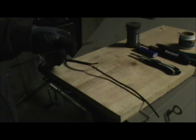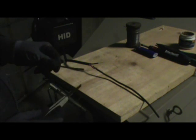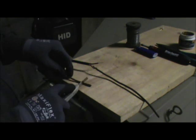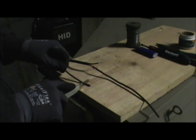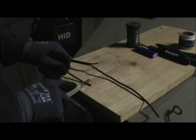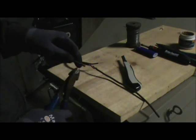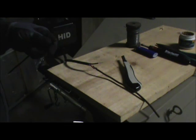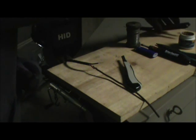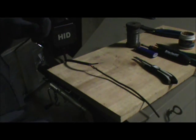I've got the wire pre-stripped. Let me show you a little trick on stripping this light wire. Take a razor knife, get the wire on a solid surface, place the knife on the insulation and gently roll the wire back and forth a little bit. It will cut that insulation. Once the insulation is cut, you can take a pair of pliers of almost any type and pull the insulation right off. Doing it in your hands, you can do it like this — I've got a lot of cuts in my thumb that say you shouldn't.